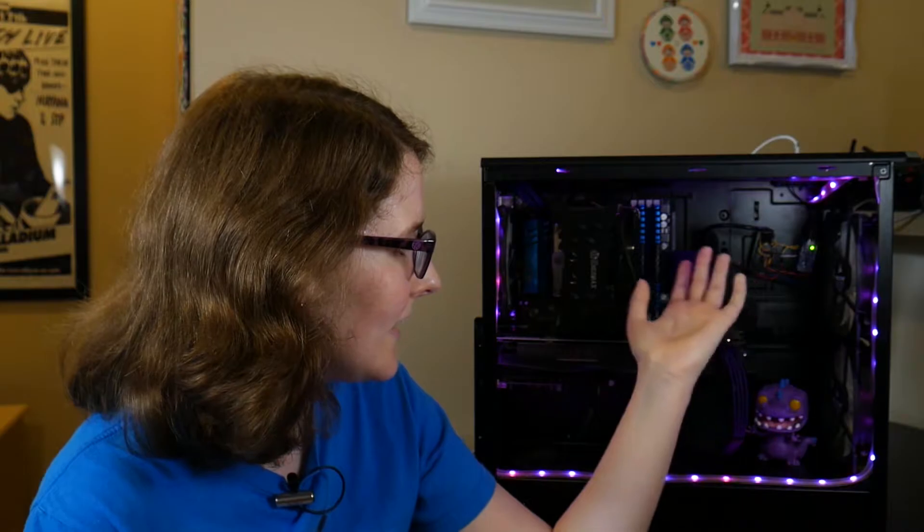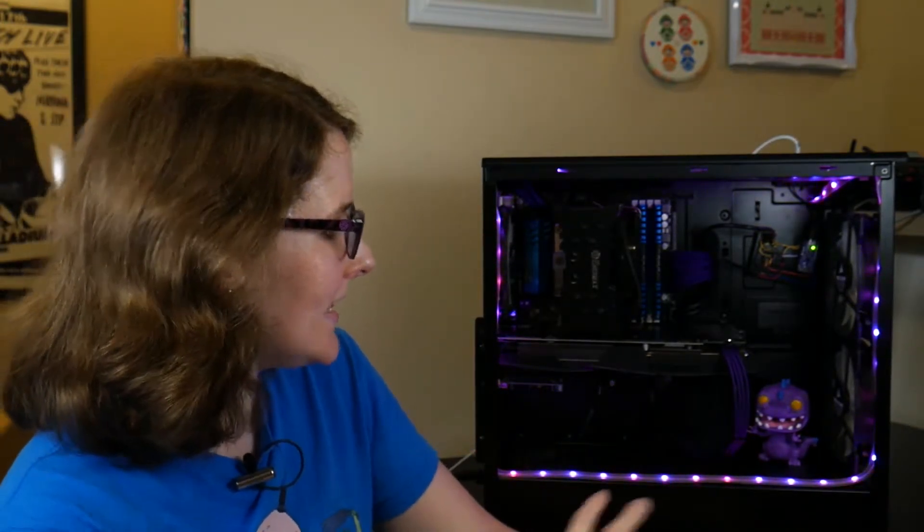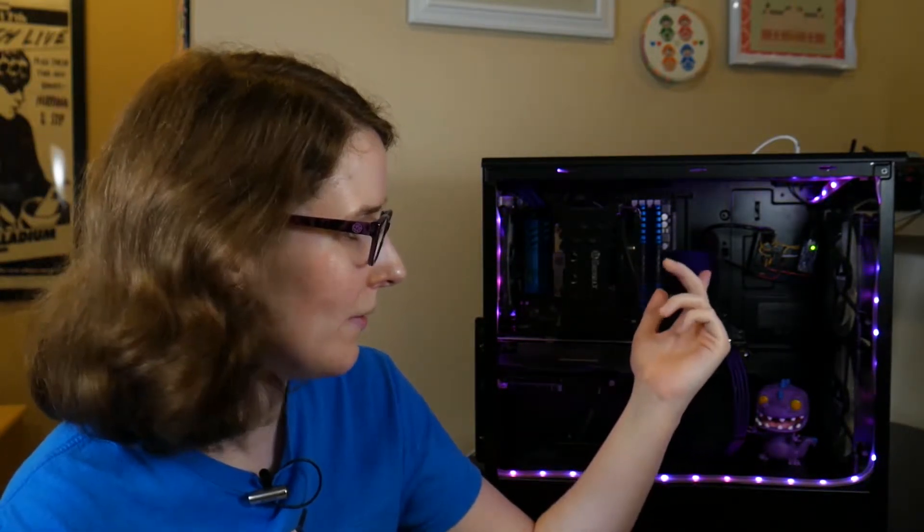It had been on my list of projects to get it into a more final form — solder all the components onto some proto board so it would be a lot more stable and finished. A couple of things I wanted to do in revamping this project: one, I wanted to get the Arduino Uno out of there. I went with the Pro Trinket from Adafruit because it has five volt power and the 328 chip, same as the Arduino Uno, so it would run the NeoPixels no issue. I also found some black proto board by DF Robot on Digikey, which I'll link below, so it looks really sleek — because I wanted to have it on the inside of my case to show off the custom board.